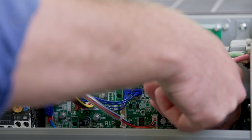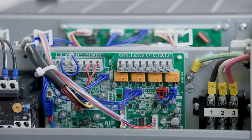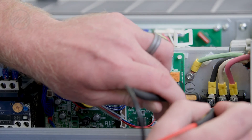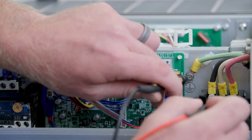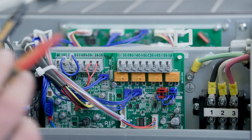If your phase is correct, you will need to remove the plastic cover, check leg to leg to ensure you have 200 volts, then check leg to ground to ensure you don't have any shorts in the unit. If the power and phasing is correct, you'll need to replace your CPU board.